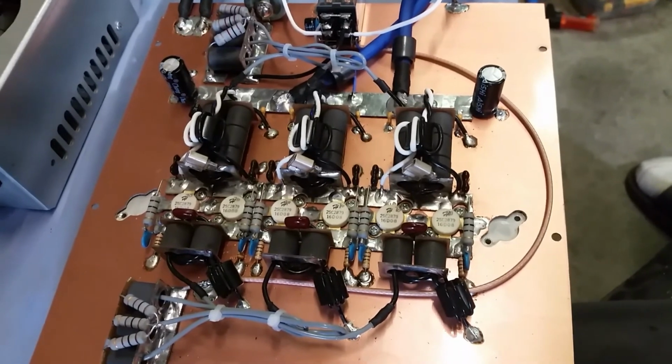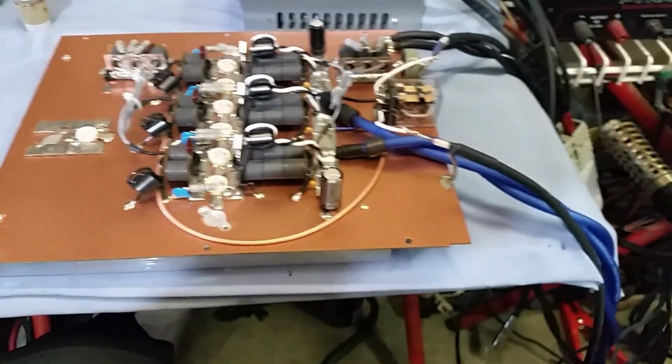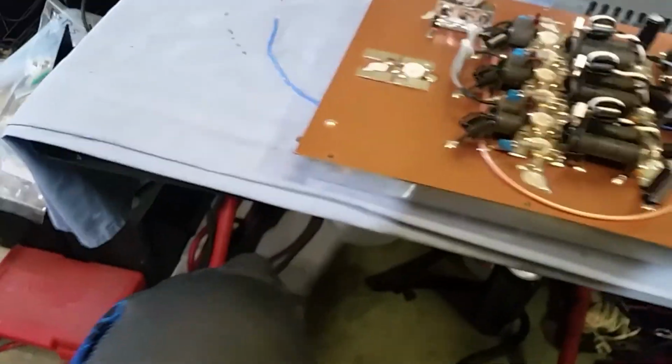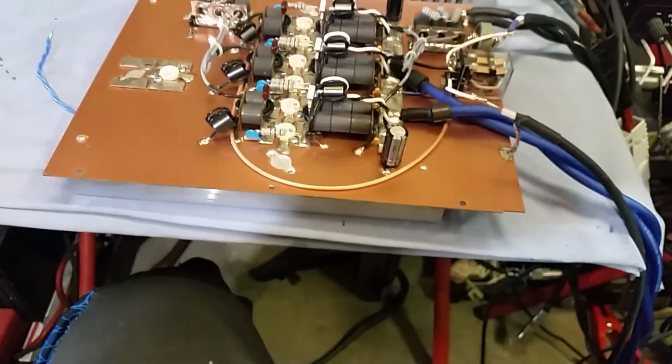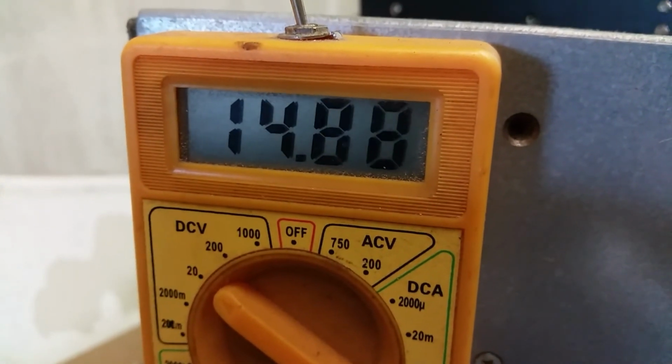Just a straightforward 6 transistor amplifier, kind of a mid-Q style. All right, I've got it hooked up to the unregulated 100 amp supply over here, and it's sucking it dry. I'm gonna have to hook it up on the bigger supply, but I'm just gonna key it real quick. This is down on 13.3 volts or something. It's sucking it dry, and we're on the bench radio. Got the 2-pill driver here, 1446 2-pill. You see, man, this thing's banging in just the peak watts already. If you're a peak fan, 2500 watt slug. The driver's on 14.4 volts, by the way. Yeah, 14.4. That's 2500 watt slug.